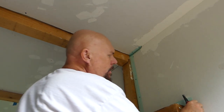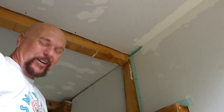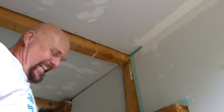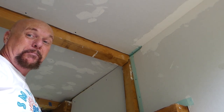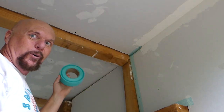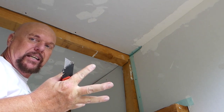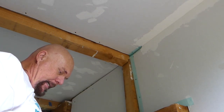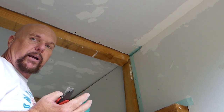I'm going to be honest, here in Texas, no matter what people say, I see a lot of brand new construction, stick built homes by big names. I go in for the tour and I'll see cracks in the corner already. And I think either they didn't compress the clay right, or they're on black gumbo. Black gumbo rolls and just changes dimension. I'm on a reddish clay here, and when it gets wet, it doesn't seem to expand. I haven't had any big cracks during the 2 years of drought, just a little crinkling on the top. And when I leveled this on the temporary blocks, it stayed right where it was.